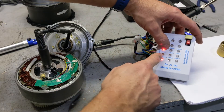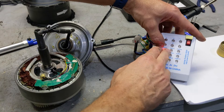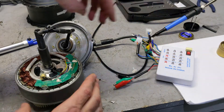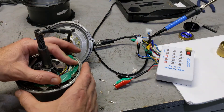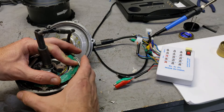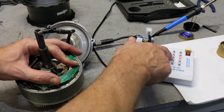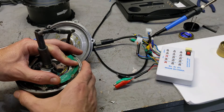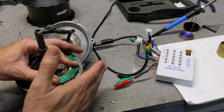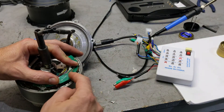You see there's three lines over here. These are the hall sensors. These have to go in a certain order. And when you spin the motor, the sensors are supposed to change. You see how it changes every time? That's the problem with this motor — the green is dead. So we have to find which hall sensor is for the green because it's not working. One of the hall sensors broke.